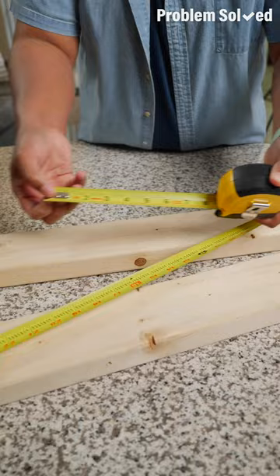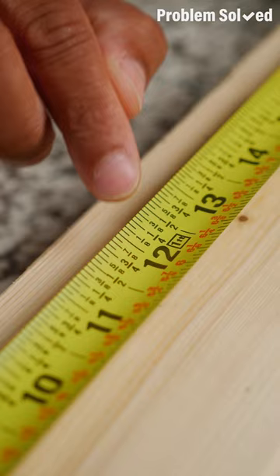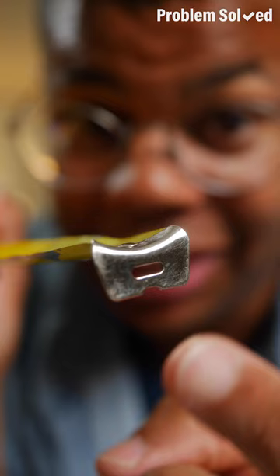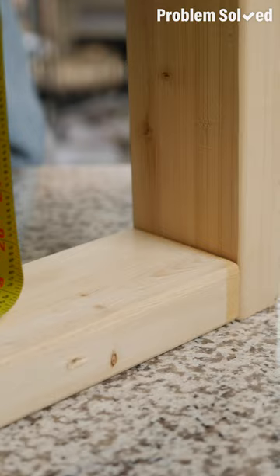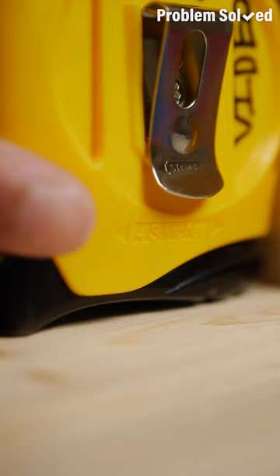Here's how you should be using a tape measure. Not every tape measure is created equal, so pay attention to the different markings and make sure you have one that works for your purposes. I like that this shows the fractions — that makes it a lot easier to read. It's helpful that this one has very large, very clear foot measurements. This is probably one of the most helpful features: the nail notch. This helps secure the tape at the end of a nail head. A push pin in a wall also helps. The right way to measure at a corner is to make sure that measuring tape is flush up against it. Tape measures will have their length listed — just add that to your measurement.